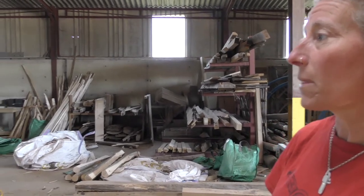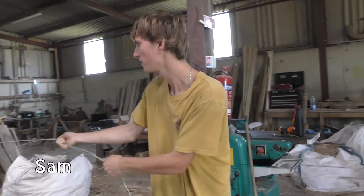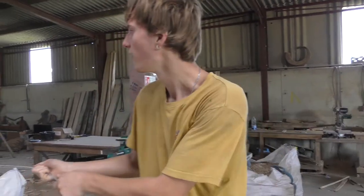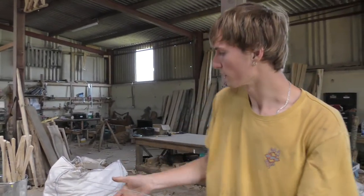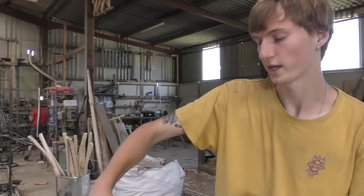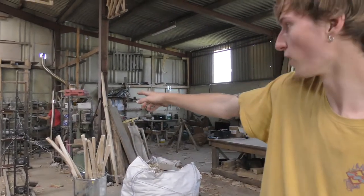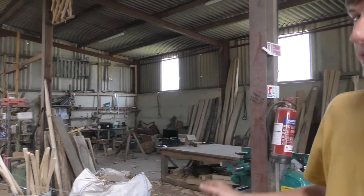Can you talk us through the process? Basically this is the centre. You line them out, wrap them around there and pull them so they get tight. So this one will be like that and there will be another one here. Same with the top and the bottom. And then as you pull the contraption along, you twist, and that's how you get the twist between each paling.